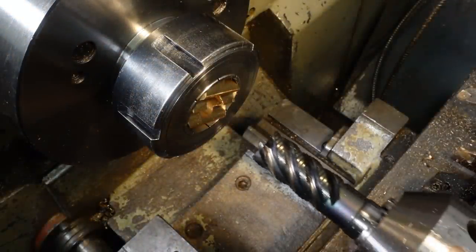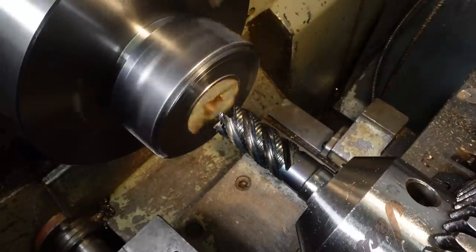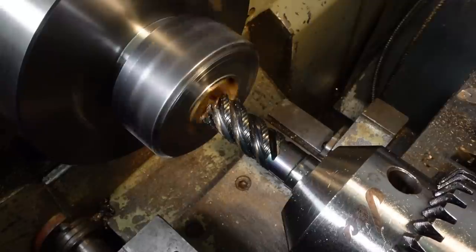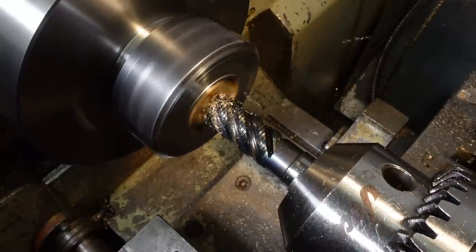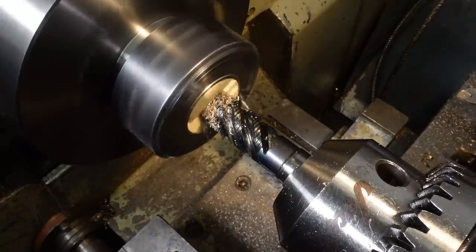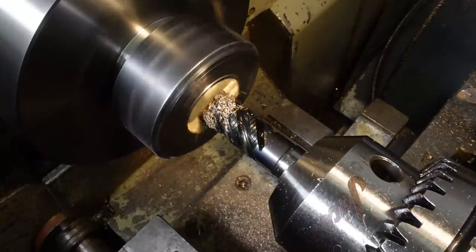Popping the jaws into a collet chuck on the lathe, I'm using a rather inappropriate 6-flute rougher as a flat-bottomed drill to cut the counterbore for the retaining washer in each jaw. I need to leave a 5mm lip at the bottom of the hole, so this gives me a perfect opportunity to use one of my groove micrometers to measure the size of the remaining lip.